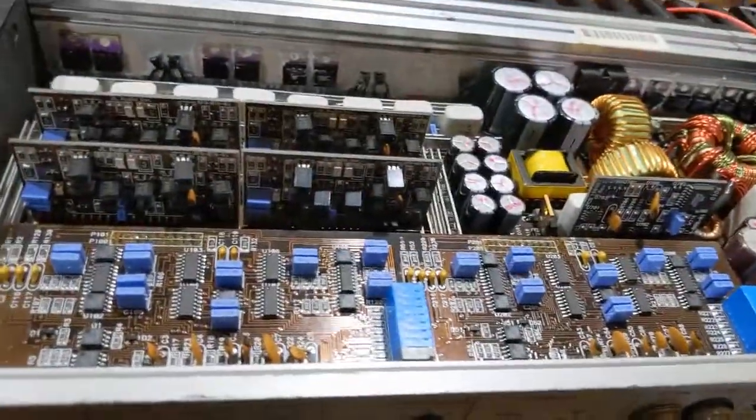So I pulled the board back out and checked everything again. Lo and behold, this 10-ohm resistor now reads like 4.7K ohm — that resistor is now open. If you look at the light just right, you can kind of see a hole in there. It was still reading alright before, but now it's not, so it's going to have to be replaced. Since these are known for going open anyway, I'm just going to go ahead and replace both of them.